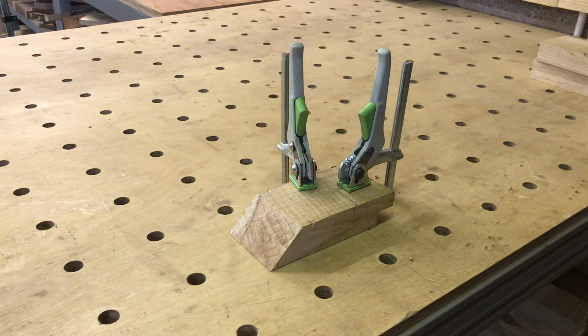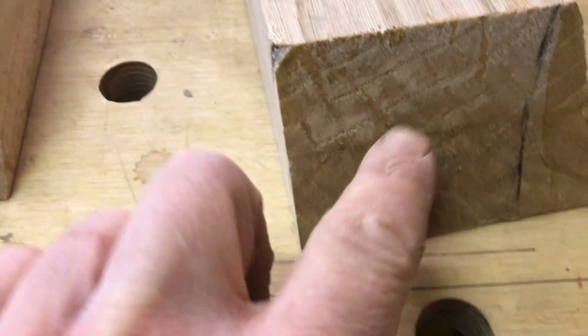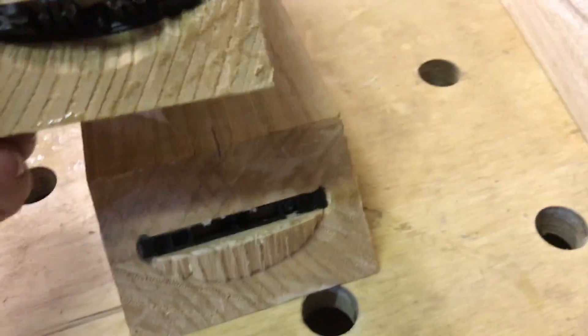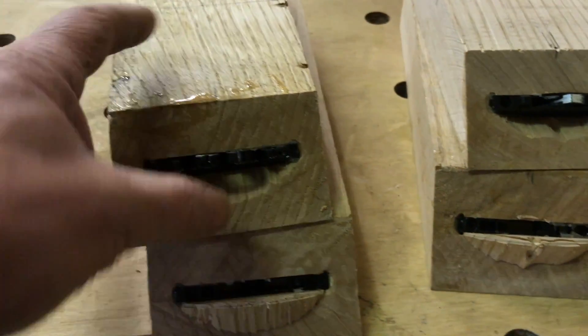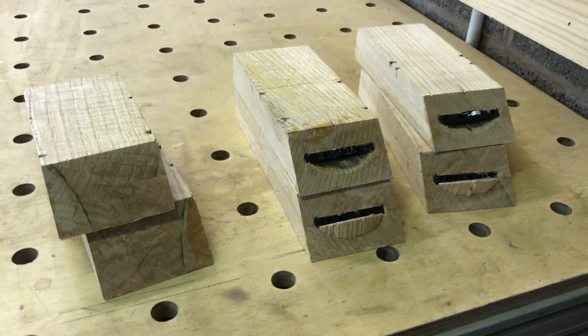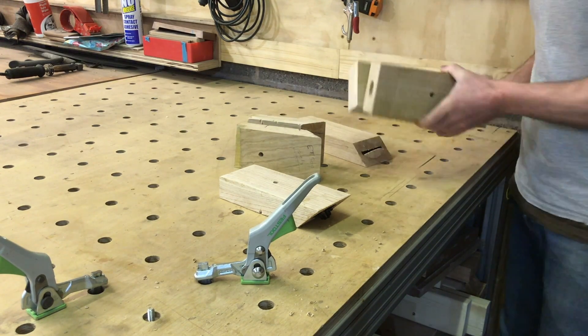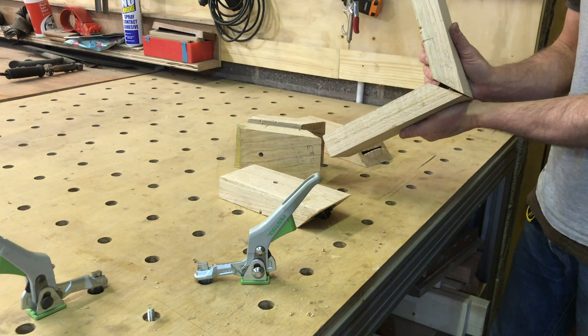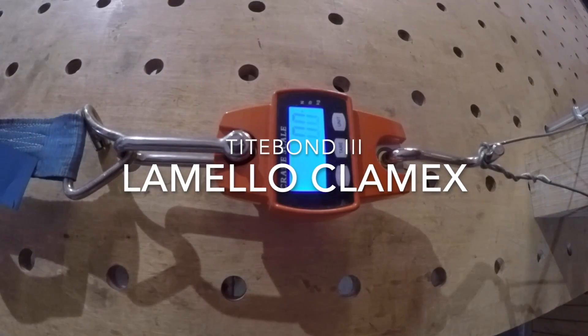ET500 is way outperforming any wood glue obviously. Looking at the failure on the English chestnut - this one shows a bit of grain tear-out, and these are both really interesting. They've both kind of cut themselves a little biscuit in around that joint, so they're really well glued. The difference - and I'm not sure it comes across on video - is that with the Tenso and especially the Clamex, it takes longer to break the joint. The readings seem close for the two ET500 joints, but as soon as it hits high load, the non-connected joint breaks and shears, whereas the Clamex really holds on and takes ages to break. It's adding a lot of strength. Next up: Tight Bond 3 with the Clamex.